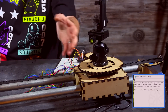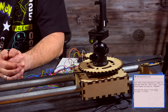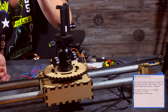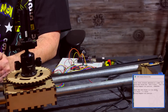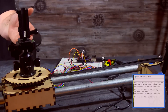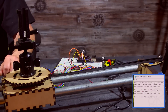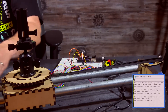I'm going to enter 0,0 to go back to the origin. Enter that — and there it goes. Both steppers are moving at the same time, independently and simultaneously. The AccelStepper library is really good for that. Now we're back at the origin. Let's say I just want to do a rotation and not a linear movement — I'd enter zero comma 400 to go clockwise. At this point, only the rotation is moving; the slider is not.